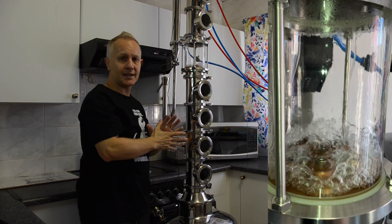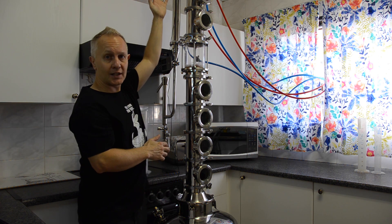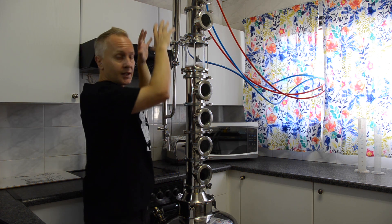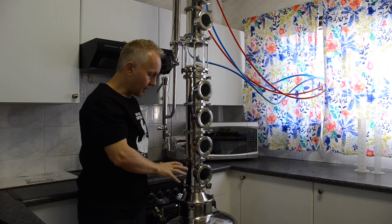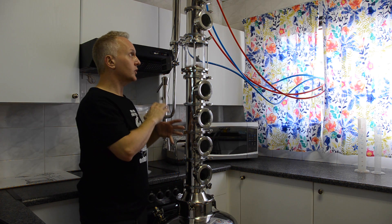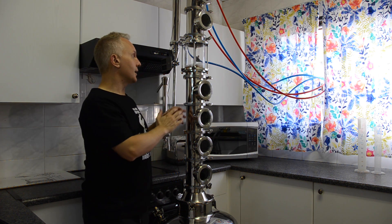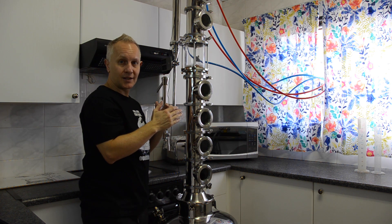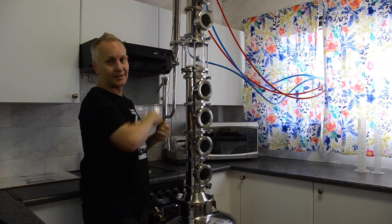There's still a bit of fog here but hopefully it will get better as it stabilizes out more. I'll stabilize it for at least half an hour — leave it as is. The reflux is 100% open so I've got 100% of the vapor getting condensed and pushed back down. After half an hour I'll then start to close my reflux condenser and see at what point of closing we get liquid to start pushing out.